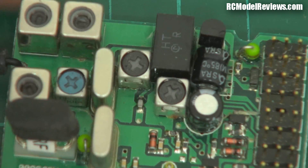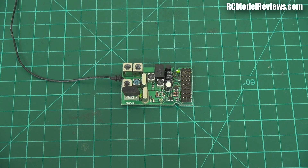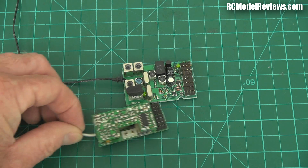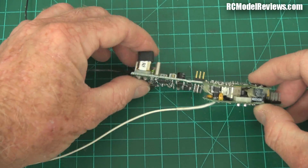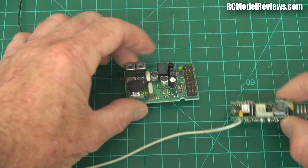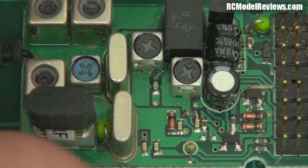This one is from Hi-Tech and it's much bigger. It's an eight-channel receiver but look at the size of it. That's the Hi-Tech receiver. This is the Airtronics one beside it. You can see this is quite a bit narrower because they've used two boards, but overall it's probably the same amount of components. They've increased the height a bit by using those two boards stacked like that. This is just a single board FM receiver by Hi-Tech — it's much easier to see what's going on because it's all laid out on a single board.